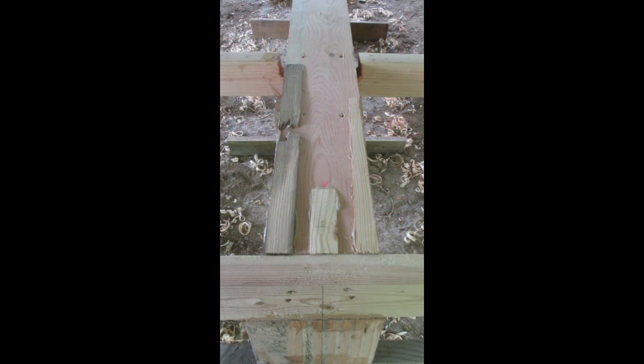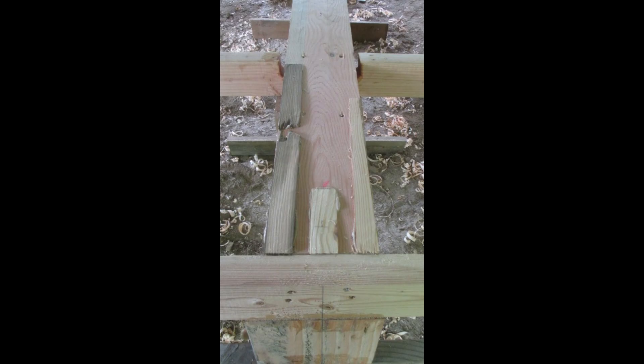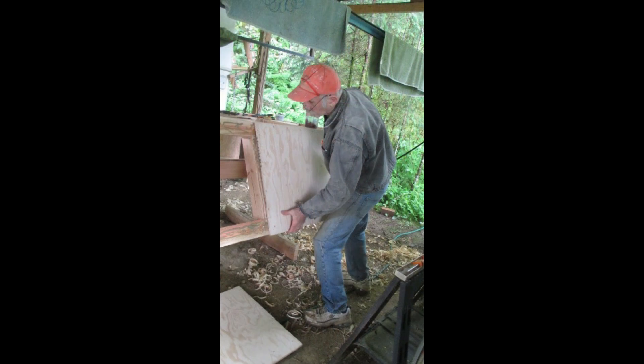After fairing the transom, I realized the keelson was not flush with the bottom. When framing the transom in the basement, I'd made sure the center bottom gusset was far enough from the edge to allow room for the keelson to butt against the transom, but I did not position the gusset precisely in line with the top of the keelson. When I screwed and glued keelson and transom together, the keelson had slipped and was resting against the gusset. I added tapered shims. When I measured the shear clamps on both sides from transom corners to the point of the bow, there was only one-eighth inch difference. I spent time with paper, pencil, and calculator figuring out how to cut three sheets of plywood to cover both sides of the dory.